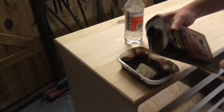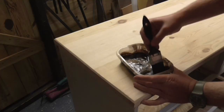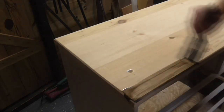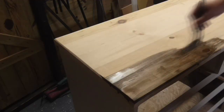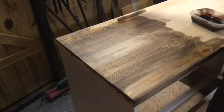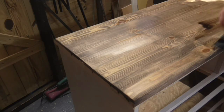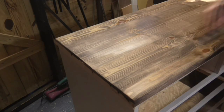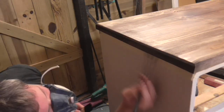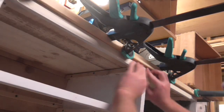I used a mixture of about 50% dark teak stain and 50% white spirit, as when I used the stain on a test piece I found it was a bit too dark, so the white spirit was just to thin the stain. I used an ordinary paintbrush to apply the stain, and an artist paintbrush to apply the stain onto the bottom panel. Earlier I'd applied masking tape around the top of the carcass to prevent getting any of the stain over the painted frame.